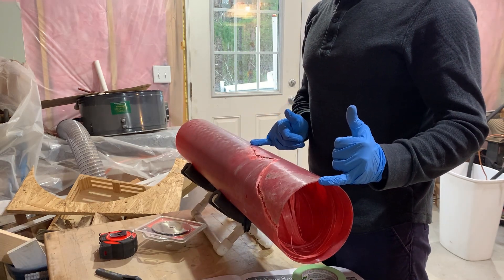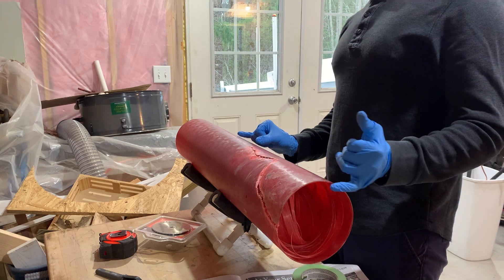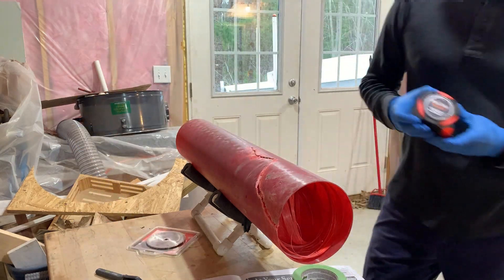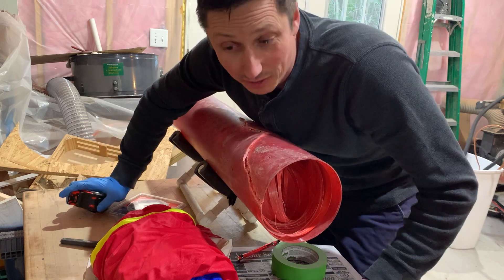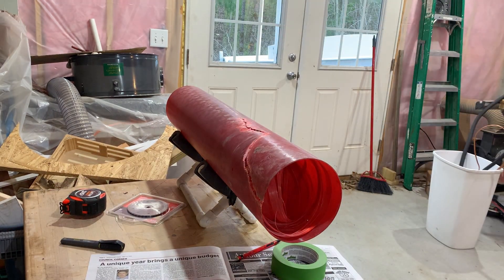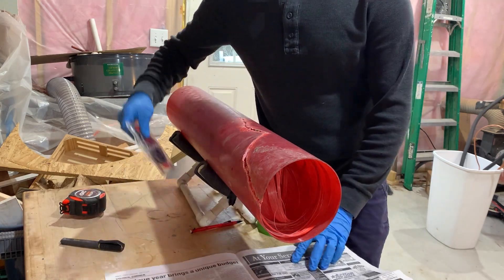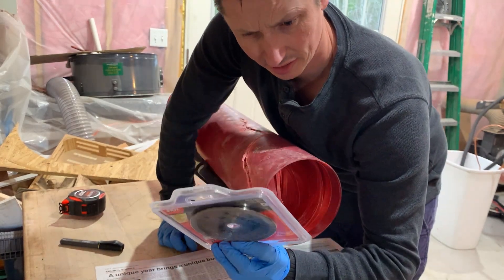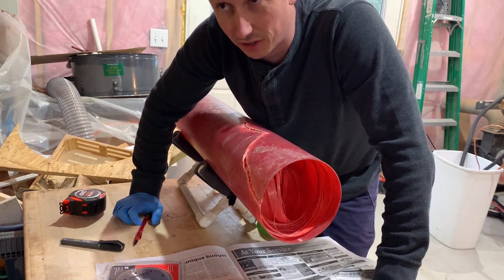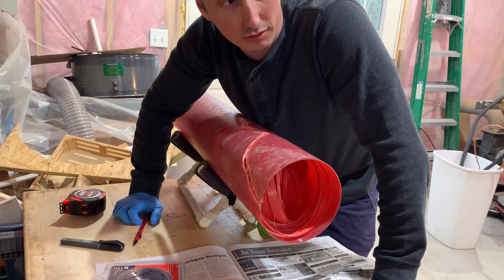Basically I'm just going to cut 14 inches off of this payload tube, and hopefully that gives me enough for the nose cone and AV bay to smash in here. I should probably measure that real quick. You know, we're just going to cut this and then we'll see if I have to order more fiberglass at the end of the night. So I'm basically going to use a piece of newspaper as a guide to give me a straight edge, and then I'm going to try one of these Skilsaw diamond blades — it's for masonry. Taylor from Rocket Channel on one of the Rocket Vlogs live streams mentioned that he likes cutting fiberglass with these, so I happen to have one in the toolbox, so I'm going to try it out.